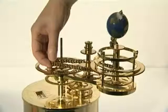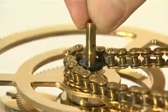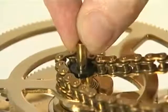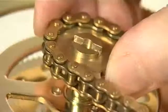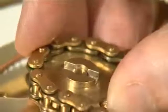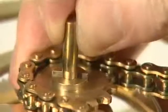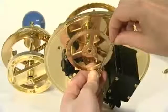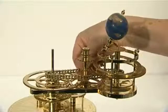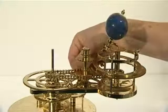Slide the chain over and around the 22-tooth chain sprocket on the central shaft. Slide the main drive shaft down to its lower limit — you will have to release the grub screws on the locking collar and 20-tooth gear below the engraved gear. Wrap the free end of the long chain around the 14-tooth sprocket and place the sprocket onto the top of the main drive shaft. Finally, slide the drive shaft upwards and re-tighten the grub screws on the locking collar and 20-tooth gear. Check that the long chain is fully engaged with all teeth on the 22-tooth sprocket and both 14-tooth sprockets.